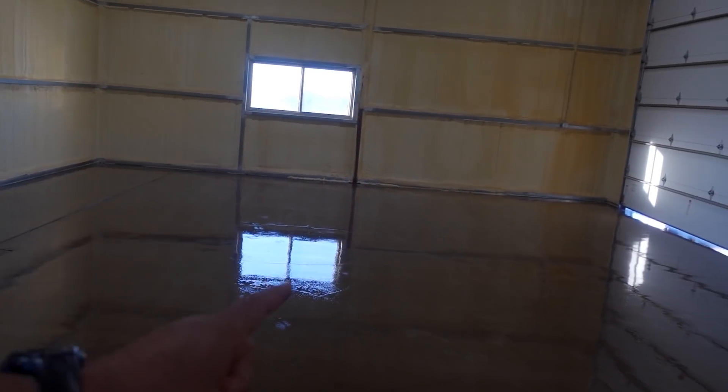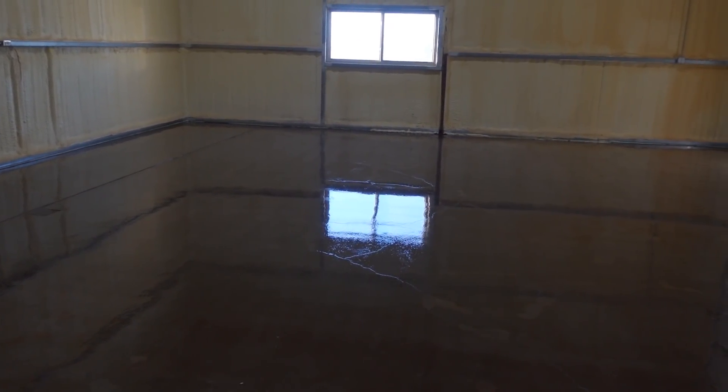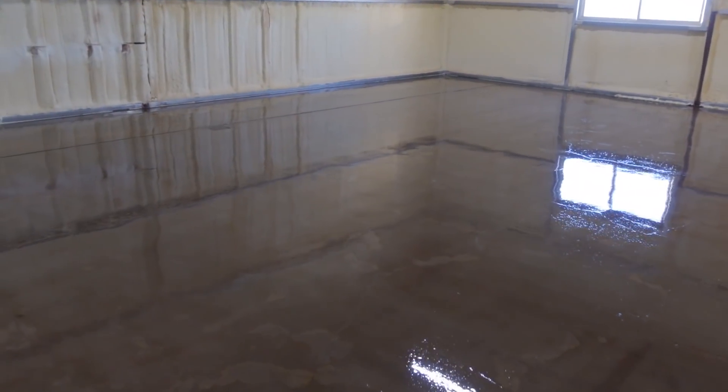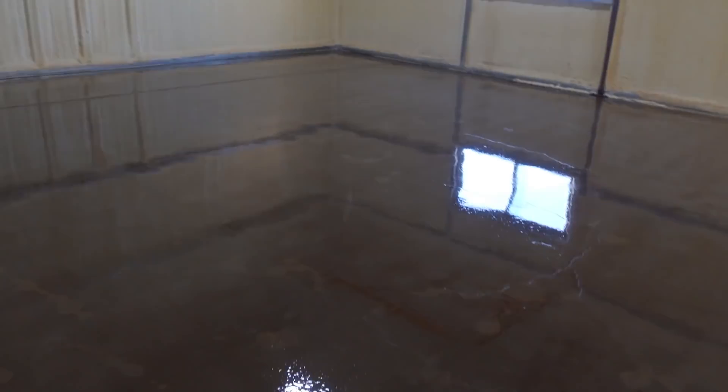That second coat I'm putting on with the color — actually it'll be the third coat — is going to be more scratch resistant than what's on here right now. So really no downsides to doing the color. We're doing polyurethane; the first coat was epoxy just to fill in all the uneven spots and cracks, which it did. Now just gonna put some polyurethane for a really nice hard long-lasting coat. All right, enough talking — let me get to work.